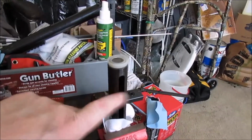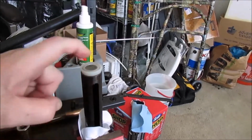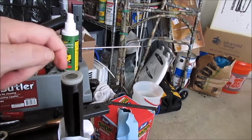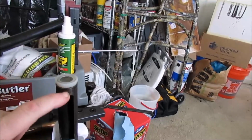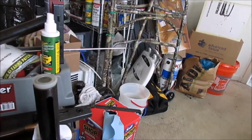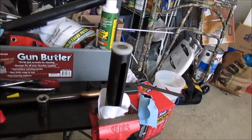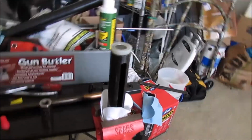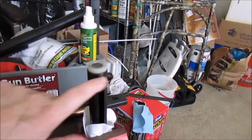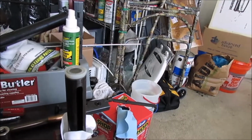That thing's blued inside and out too, incidentally. That was interesting. But if I ever get a metal lathe, this is going to be a separate part with a real shallow hole in there, and a threaded shaft on the other side that goes into a hole in here with blue Loctite, so you don't have to kill yourself getting that seal on there. Just crank it down real tight. You get it back together, and all the heat from compression of the air will help cure the Loctite, which will be sealed from the center of the shaft that goes down in here, so the oil don't get to it, and bam, that should be fine.